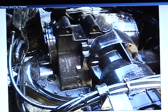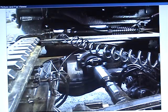And here's what the Mack rear end looks like from the top, looking down on it. It's unlike any other, but the drive line is straight. There's no angle at all to it, like the steep angles you'll see on Eaton rear ends. And there it is, looking over the top of the front one. Here's the front axle, down here where this torsion bar is, and the drive shaft that runs from it to the second rear end. This is the very one in the very back of the truck, and then it goes down, and the banjo, that's what the housing is called, goes across here to the brakes, and the axle was over the other side. I mean the wheels that are on the other side of the frame rail, and here's the frame rail on this side of it, right here, if you can see the cursor moving.